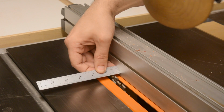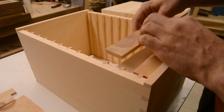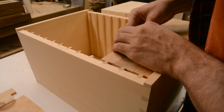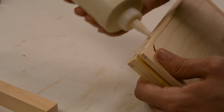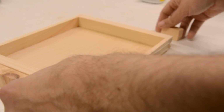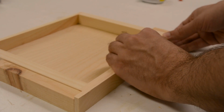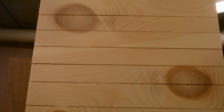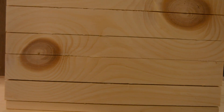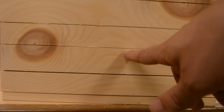My drawers are different sizes, and the tolerances have to be pretty high on the spacing of them, so I work my way out from the bottom, cutting each groove for the drawer slide individually. Because I was careful in how I spaced the drawers, I don't have to be as careful about how I glue the drawer fronts onto the drawers. I can just glue them all flush with the bottom and know that they're all going to be pretty close. I did end up with one drawer that was sitting high, so there's almost no gap at the top and a larger gap at the bottom.